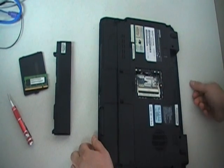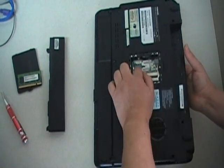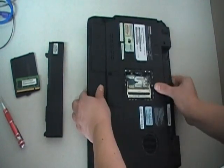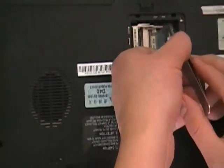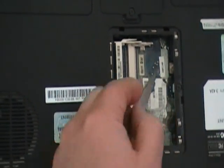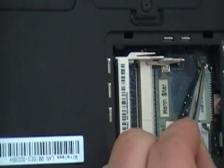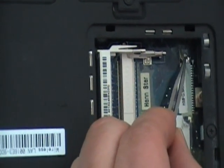You are going to remove the film — the clear film that's covering the actual jumper section. Flip over and remove the plastic. Be very, very careful — extremely careful. You are only working on this area here, this section. You can see a T and a U on this jumper here. The actual one we are going to short out is the U, so don't make contact with T or you might damage the board.